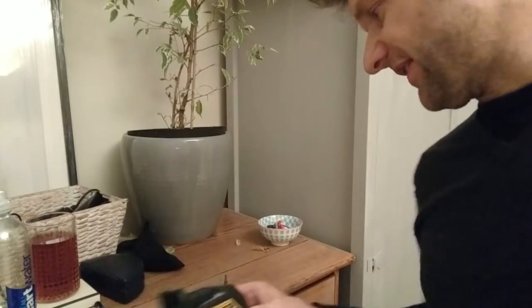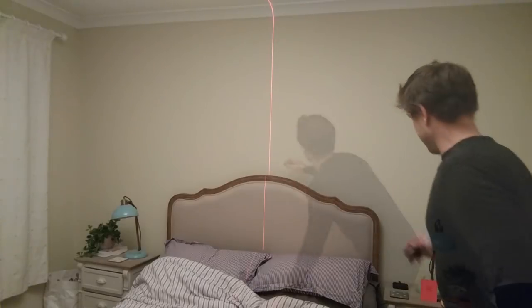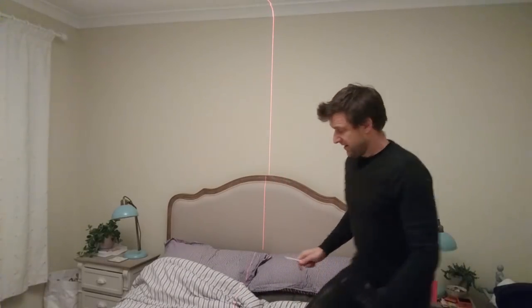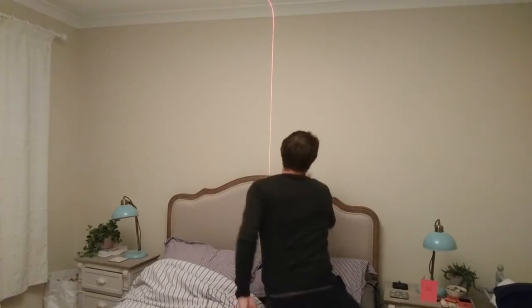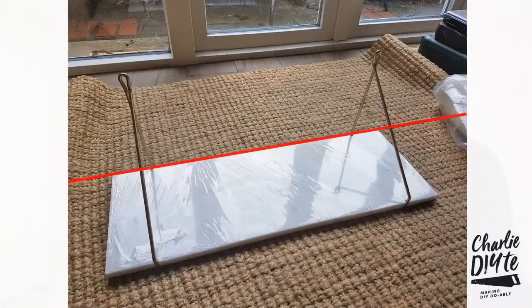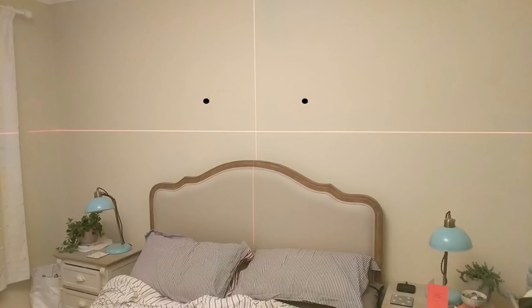I've got this cunning little gadget here — a DeWalt laser level which I have for the day job. Clearly most of you aren't going to have one of these, but it just makes my life a bit easier. The laser is now in the center of the bed and I'm going to mark a pencil line roughly the height I want the shelf. I've already held the shelf up — it's a good idea to do this with your partner. You can hold the shelf up where you want it and then one of you can draw a line denoting where the shelf is going to go. I now have the center line and a horizontal line for the shelf position marked on the wall, and I measured from the center to the left and right to mark the exact position of the two screw holes.